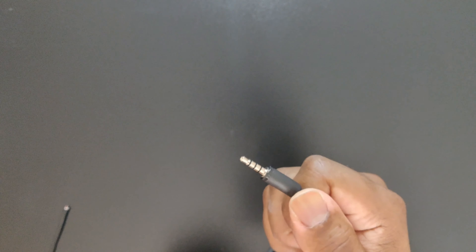Now that we talked about most of the connectors for hooking up components and your TVs, let's get into your speaker wire. You do not want to have anything that looks like spliced wire as part of your system. You don't want any of these little push clamps, separators, or anything like that. This is essentially a mistake waiting to happen. You're not entirely sure if your connections went all the way through, or if you have insulation stuck inside causing a poor connection, or if it cut completely through severing your connection.